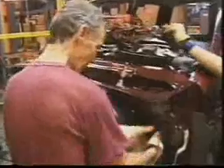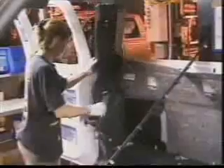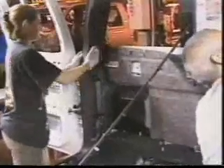An instrument panel is installed as a single piece. This is just one of the assembly areas where we see automation working hand in hand with manual labor, improving the process. Once installed, the dash cover and passenger assist handle finish the job. Trim and seat belts for the outboard rear seat passengers are installed, along with sill trim for the rear window.